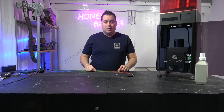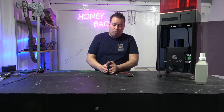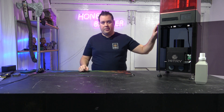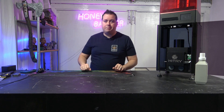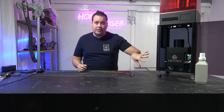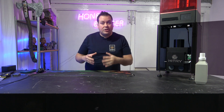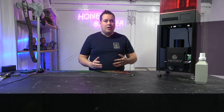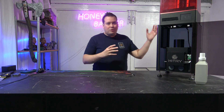Those prints came out exactly as you'd expect from a 4K printer, with almost no changes to the Chitubox profile. This is printing at 2.1 seconds per layer with a 25 second burn time, and it's absolutely powering through. They also have a speed resin that brings cure time down to about 1.1 seconds, and a high-precision resin at about 2.2 seconds a layer - really MSLA speed. But you've got the benefit of that SLA lifespan alongside 4K quality.